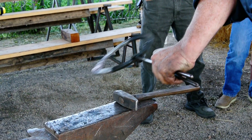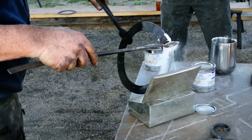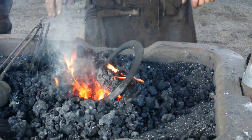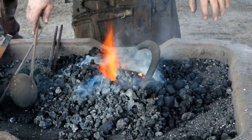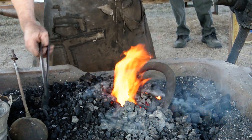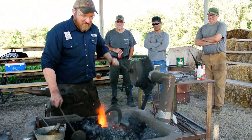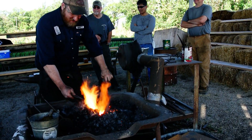Because it's now good and stuck, I'm just going to switch to the borax — it's cheaper. It is cheaper, but so am I. Thrifty, thrifty — that's thrifty, not cheap. So I'm going to take it back up to that temperature. I like to leave a little bit of coal on top. I took the coal off so you guys can see the color, but it's best to leave the coal on top because every house is warmer if it has a roof. The walls help too. That's why it's not that warm in here — which in our case is a good thing.